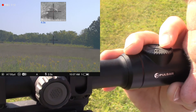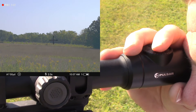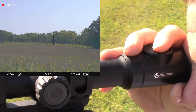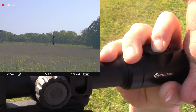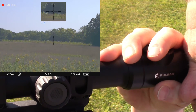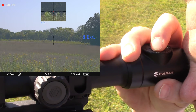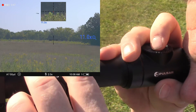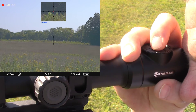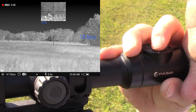His question was specifically: what if I want just the thermal channel — let's say it's gotten dark and I want the thermal channel alone? What you're going to want to do is long press, make sure that you're not on a blended screen but just on a stationary main screen. Then perform a long press on the plus button over here to turn on the PIP. Now you can see I have control over the PIP the way I explained previously — short presses to step zoom, and rolling the encoder will allow me to smooth zoom. But I'm all color at the moment, or if I do a short press, I can do all thermal from the same point.